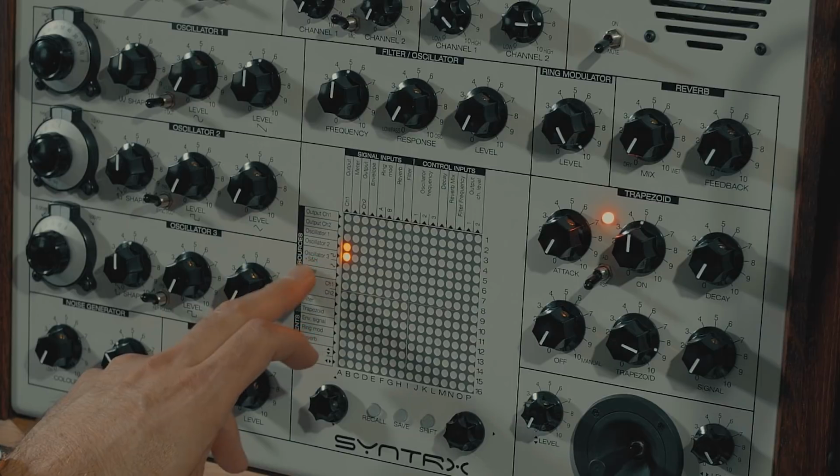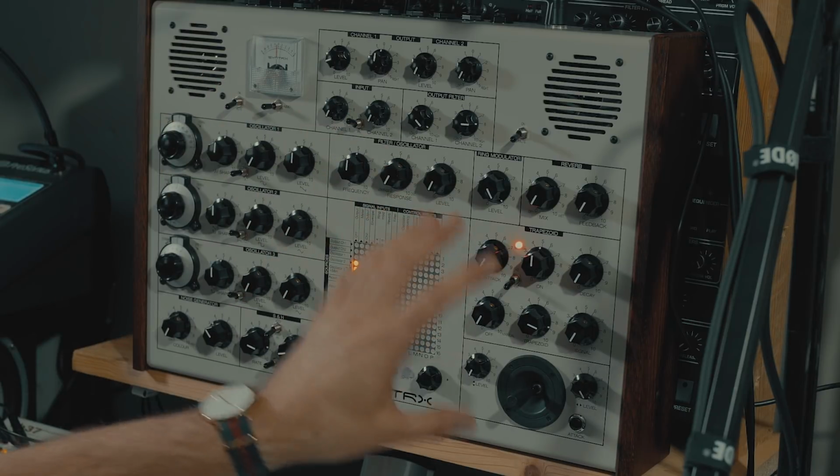So it's basically driving the sample and hold circuit, in as much as if you enable the sample and hold circuit, then you're kind of taking over the audio output that the oscillator 3 would otherwise be using, or certainly the triangle wave would certainly be using. And on the matrix itself, you can see it says oscillator 3 and sample and hold. So you can't have sample and hold values being generated and usable within the synth at the same time as the triangle wave of the oscillator number 3, which is a bit limiting. You've either got to choose, do I have LFO or do I have sample and hold? You can't have both.